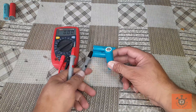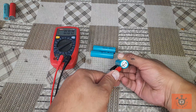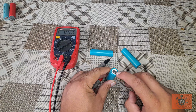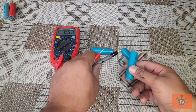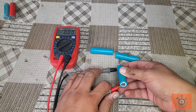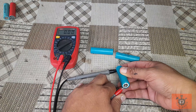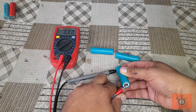Here you can see that they are actually at zero volt. Sometimes this happens when they become overcharged. There is a safety mechanism beneath the positive terminal which helps them to detach from the circuit and turns them off. If they were truly dead they would show a little bit of voltage — 0.5 volt, 0.1 — but this zero volt is actually showing that they are not totally dead.